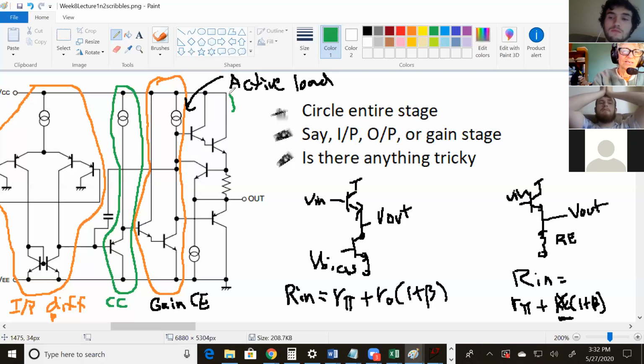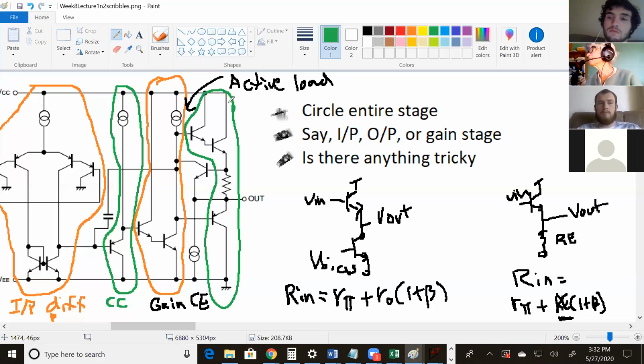So, there we go. I agree. That's the push-pull right there. And then how do you figure out what voltage you have to have between here and here? The important thing to get rid of crossover distortion is to find the two inputs and make sure they're a certain voltage apart. But how do you figure out what that voltage is? You follow from the top base to the bottom base and count your VBEs. Okay, exactly. And how many VBEs is that? 3. 3.